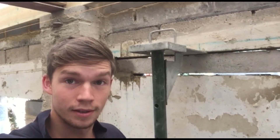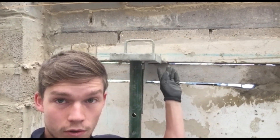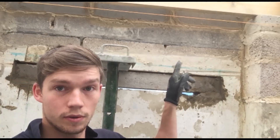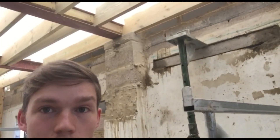So it's a new day and I've lifted the lintel in place with the help of someone else. You can see now that I've got mortar on either side, and there is a gap above. I had to reposition this acro prop because it wouldn't fit on this side — the gap was too small — so I just took one of them out and shuffled it over. Also, these bricks are still being held up by the side of the wall. We're already single storey so there's not much weight, but if you've got two storeys, make sure you're careful about how you position the acro prop so that things don't fall down.